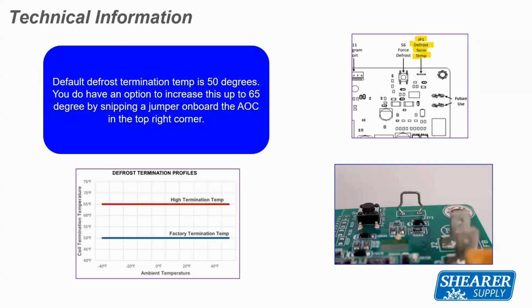Now, let's say you have a Y1 call and it's actually hot outside. We're in the middle of July and August. It's 95 or 105 degrees, depending on where you live. It's going to increase that 70% by a couple percent. So now it's going to bump up the compressor by a couple percentage points to make up for that additional load outside, to try to see if it'll satisfy it at Y1 at that point.